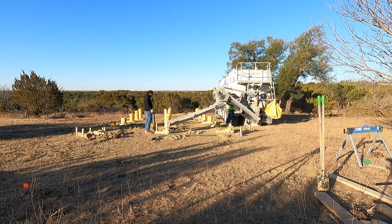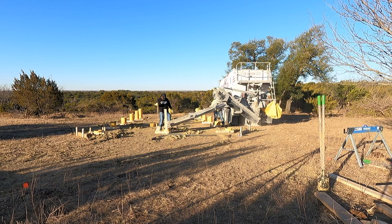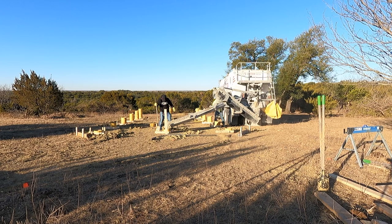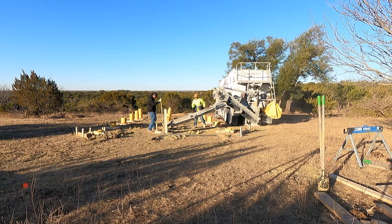As you can see we already started pouring this concrete. My biggest issue was that I didn't secure my sonotubes enough. They were okay — we got away with it — but if I were you guys, I would do a tall A-frame support system for any sonotube that's above about two feet out of the ground. Otherwise, when it gets filled up with concrete, it will have the ability to lean out of plumb.